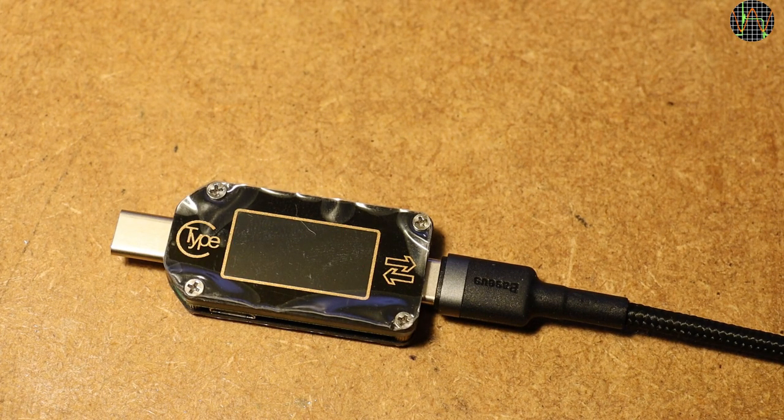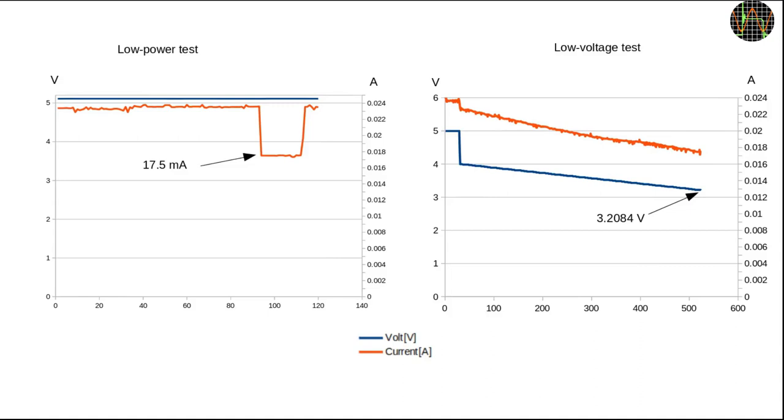Now that the display is off, I wait a few seconds and then turn recording off and analyze it. Interestingly, turning Bluetooth off makes no real impression — low energy indeed. I ran an additional test with Bluetooth actively running and current did not increase in any significant way. But the backlight makes a real difference: the current drops from just below 24mA to 17.5mA. So that is about the lowest power you can get.